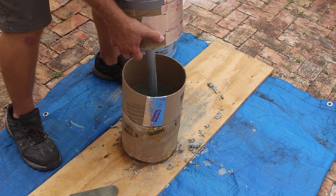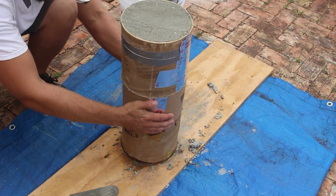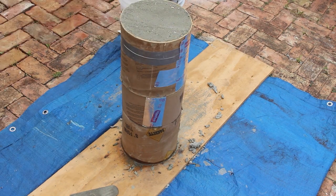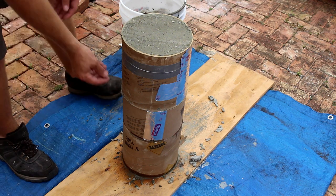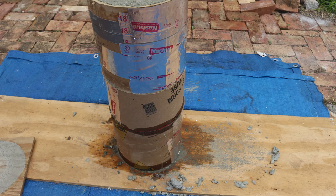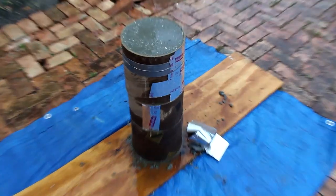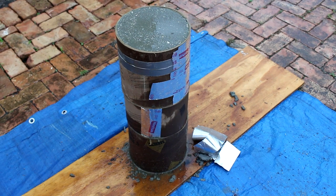The set I'm making right here is actually 65 pounds — so a little over 30 pounds on each side. That's probably the max for the cardboard spacer in the center. As the moisture from the concrete mixture itself soaks into the cardboard, it weakens the whole thing, and it could collapse if the concrete doesn't cure before the cardboard breaks down. This set actually got rained on and it was the second time I had used the form, so they completely disintegrated after that.